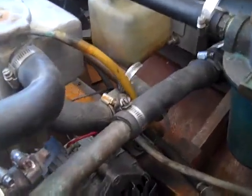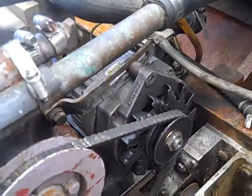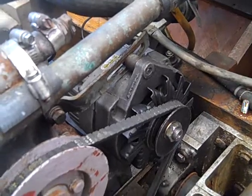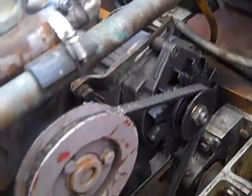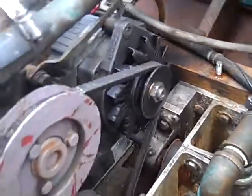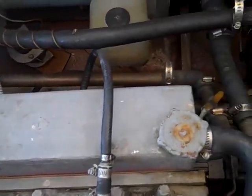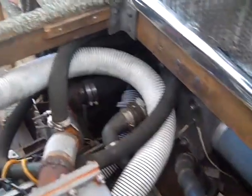There's a new belt. The alternator may not quite look new, because the trick with this is getting an alternator that looks like that alternator, but everything is set up a little different. So I just swapped out the case, put in all new internals so it all matches, and only spent about 40 bucks on an alternator instead of 400 bucks. You can actually get one through Thermo King for $120 that'll bolt right on, but in different applications like boats everything's a little different.